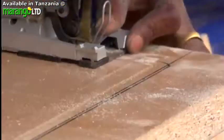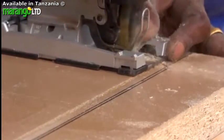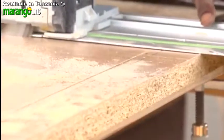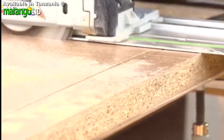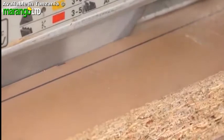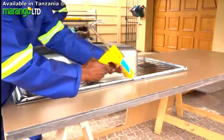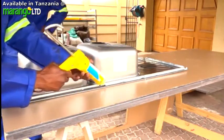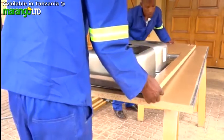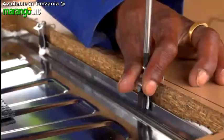Start drilling from the top of the worktop surface to prevent any chipping, then cut with your jigsaw blade from the underside. If you have two or more cutouts to make, leave at least 250mm between each one. Once you've done all the cutting, clean away any dust and seal the edges. Then add acrylic around the edge of the sink unit and position the unit on the underside of the worktop. Clamp it into place, starting in the middle and working your way outwards.